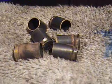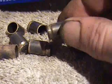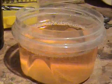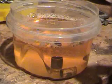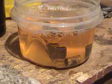I got the cases annealed and dropped them in water to cool. Since they get all tarnished from that process — it probably wouldn't affect how a bullet works, but I like things looking better — I've got a mixture of concrete etch and water that I usually use for doing a homemade parkerizing job. I'm going to use it to brighten these cases up a little bit. After they come out, I rinse them off and warm them up with the torch just enough to make sure there's no moisture left before pouring the lead in.